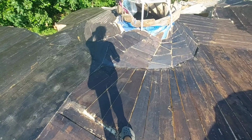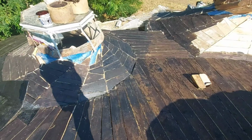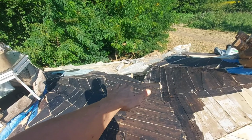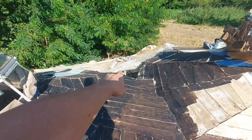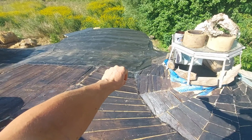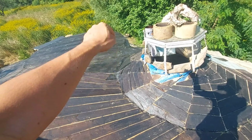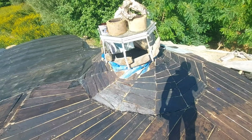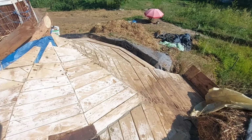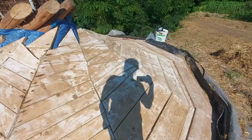In the same way in here, I started there from the eave, and I'm coming until I presume here. This is the highest point, and from here I have to take the waterproofing from that edge and go upwards until here, where I will have a top layer that will either go that way or this way. So I did the same thing with primer on this area, and it is mostly done.